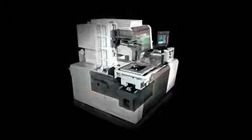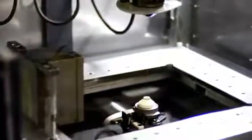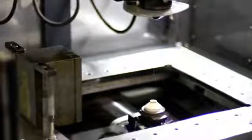On the MV series with the T-casting, you have both the X and Y axes mounted directly to a set of ways on that base casting. So the table moves right and left on that set of ways. The column moves in and out in the Y-axis on that separate set of ways. This style of direct access mounting removes the squareness and repeatability issues that come with stack table design, providing higher rigidity and smoother movement for more reliable and precise cutting.